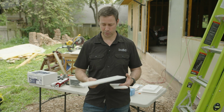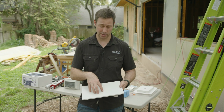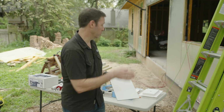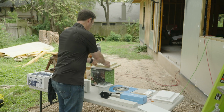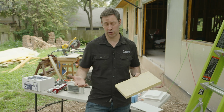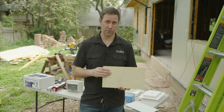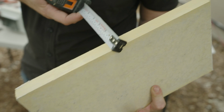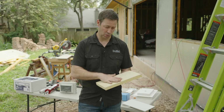Now, eventually, this is gonna be pretty similar to what my final siding is gonna be. I'm using their smooth siding. This is pre-painted. This is gonna be 6 1/4 with a 5-inch reveal when I'm all done. And what I chose to do is make all of my mounting blocks out of 5/4 material, except for one, and I'm gonna get to that in a minute. Depending on which zone you are in the US, they actually have 2 different zones in North America for Hardie's fiber cement. I'm in the southern zone, so this is their HLD trim. This is a 5/4, which means it's a true 1-inch thick. And they make this in basically all the sizes, the usual 4, 6, 8, 10, 12. Most of the time your mounting blocks are gonna be wider though.